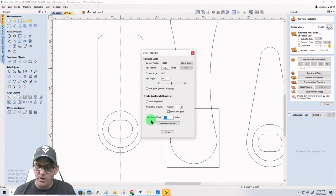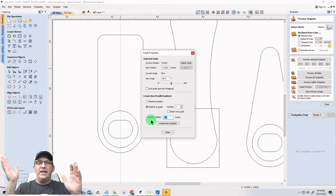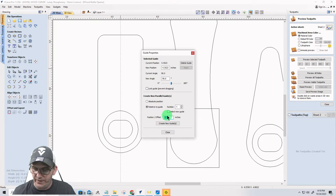My handle right now is 2 inches, right? I want to take a quarter of an inch off of each, so I want it to be 1.5. So it's 3/4 on each side. So I'm going to go 0.75 in a positive direction, number lock, 0.75 in a positive direction. And then that's going to be 0.75 in a negative direction.